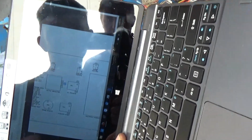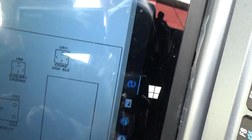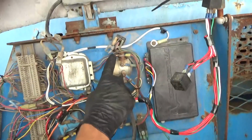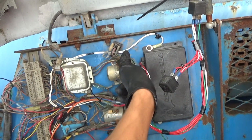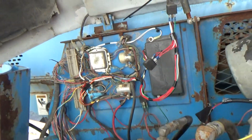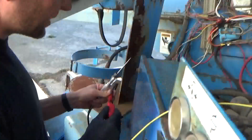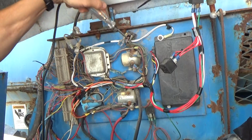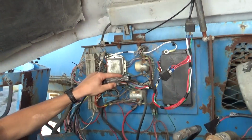A piece of tack. Okay. So we just want to see which relay is which on this relay board. And we're worried about PR1, this oil pressure relay. And up here, this guy is the key player. So let's check the load side, see the fat wires, that's the load side, and then this is the control side. So all we need is a test light, and first we test light to battery negative. This should be our constant power feed, and it is. And then this guy should get powered on when it's running, and we'll see what happens when it shuts off.